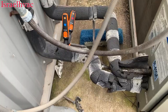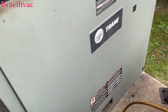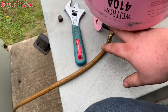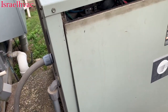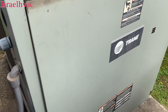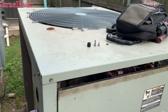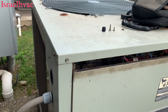Alright, we are now hooked up to circuit A — out here with the temp probes and circuit A inside. As you saw from the screenshot, circuit A is not quite as bad, but it's just about in the same boat as circuit B. So I'm going to hit my ball valve here, add a little gas, shut it off, and do that a few times until I get things where I want it. I'll post another screenshot when I get the charge where I'm happy with it.